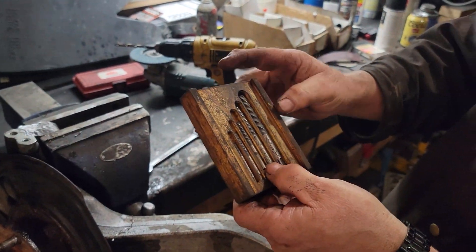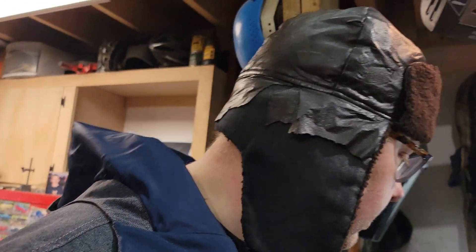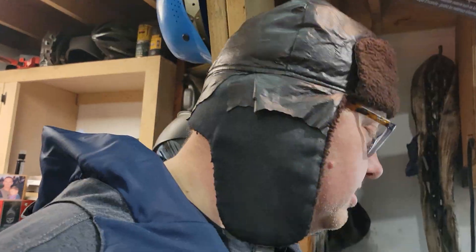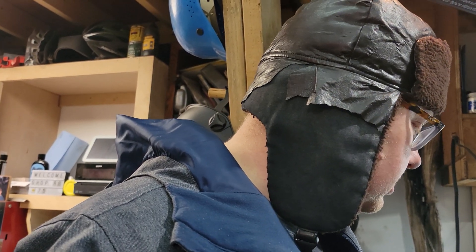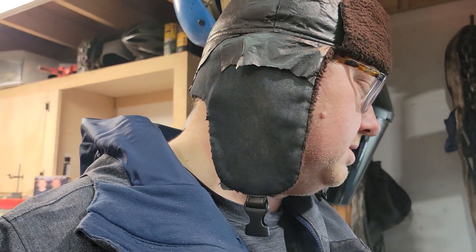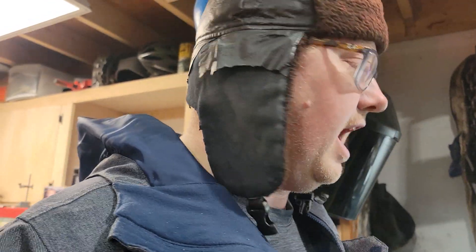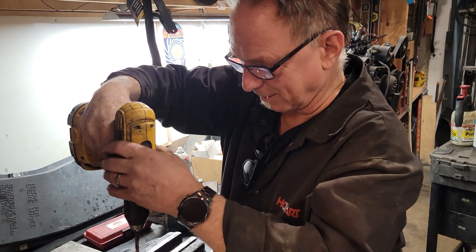If this will not move, do not use re-welded nuts and do not use easy-outs. These easy-outs are super hardened steel — when they break, they break and you're done because you can't drill them out. So if that bolt locked up before it broke, you're going to have to drill it out. Since this is not a blind hole — it comes out right at the bottom — we can drill through it and use a bolt and nut. Sometimes you can drill it out thin enough so it starts to crumble. I have used a tap to push out a broken bolt a couple times, and sometimes if you get it super thin it'll actually catch with the bit and spit it right out the bottom — that's what we're hoping for.